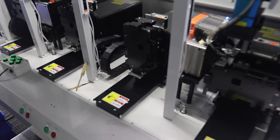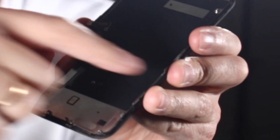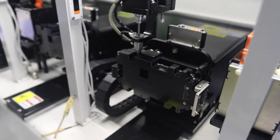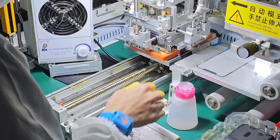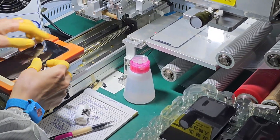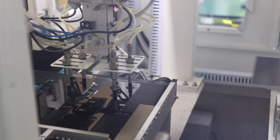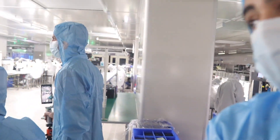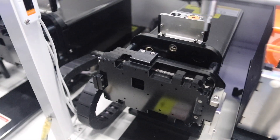For example, this robotic arm has a really interesting function: screwing in screws. If you look at a screen, there are several screws on the sides that hold the metal protector to the frame. This robot takes the screws from a little box and screws them into the screen, as another part of the same machine rotates the screen until it's finished. Other machines are not so automated — this one needs someone to press a button so it can clean the screen of dust residue. Before the screen gets to your hands, it will have passed through many metal hands. When we get to step 31, where the frame assembly is done, we notice how quality and efficiency come together: what a human can do in one minute, this machine does in five seconds.